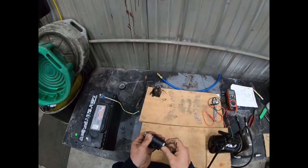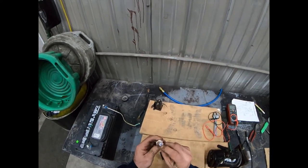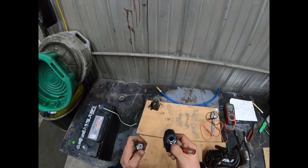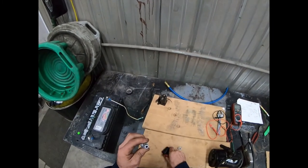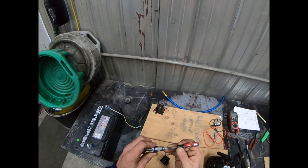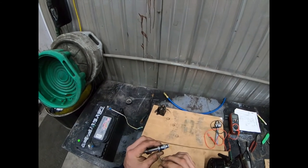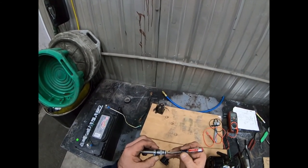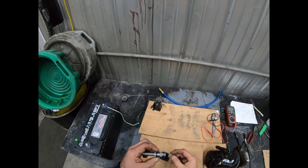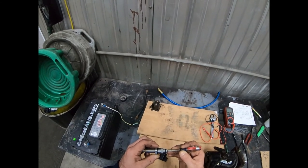To check the shuttle, you don't have to remove the whole solenoid — just take the nut off the back and the coil comes right out of the cartridge. One end is solid and can't do anything, but the other end exposes the plunger that is normally operated by the magnetic field from the coil. Put a small screwdriver in there and you should be able to move it in and out about an eighth of an inch — it should move freely. There is a mechanical spring inside that returns the valve to its resting state, but when the magnetic field is produced the shuttle moves. Make sure it moves freely at least an eighth of an inch.